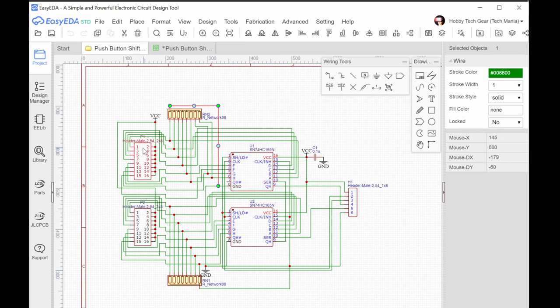When a normally-open switch is open, nothing happens. When closed, it shows zero and MMJoy detects it as pressed. This single shift register board can handle 16 inputs with two chips. You could create a 32-pin or 8-pin board, but I created one with two chips giving 16 digital inputs using shift register configuration.